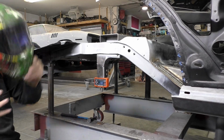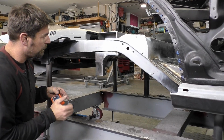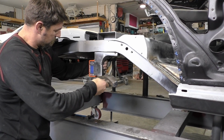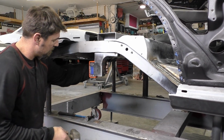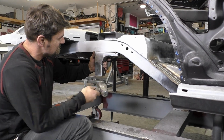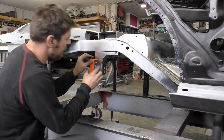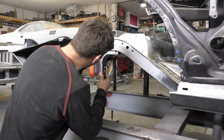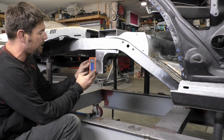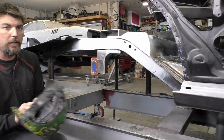Actually, now that we got that one tack on there, let's see if we can adjust it just ever so slightly. It shouldn't fall down now. So it's gotta go. 89.7 might be 90. There's 90. 89.5. So we gotta go a hair. Since we're 90 here, 89.90, we're gonna hold this here, and then we're gonna try to give it one pop to shoot it the other way.